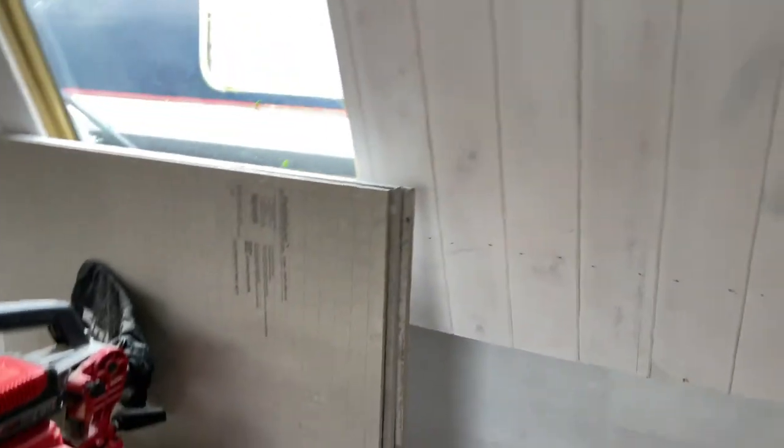But I settled for calcium silicate board, CS board, for around the burner to the back. There's some Hardie Backer which I've already bought, which is like a tile backer which you can put on the front of that with an air gap. I need to relook what way around it goes, but I think board, air gap, tile backer, I think.